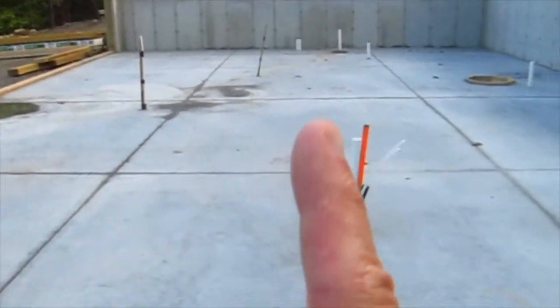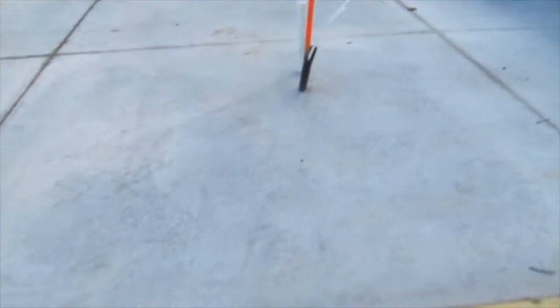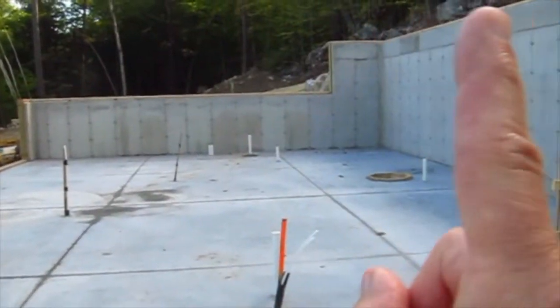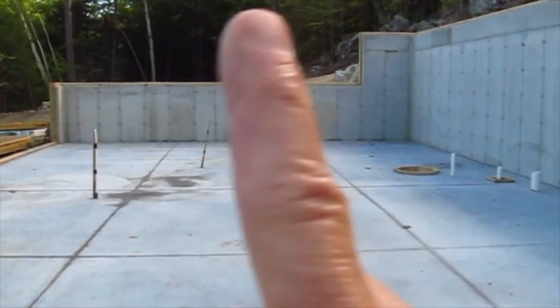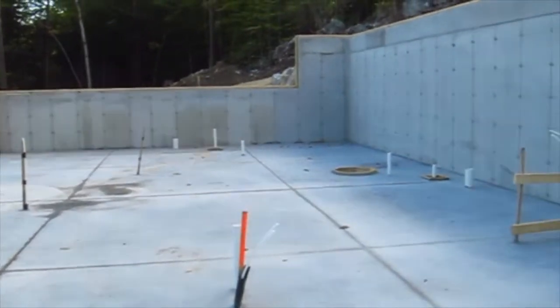So we're going to see a big, giant, long beam go this full length from here, from the mystery 6x6, all the way over to that wall. And that way, the floor above those giant, long truss joists, they will not be springy at all. The span then will only be about 14 feet on either side of the beam. So that should work out really well. As you can see, a lot of fascinating lumber.